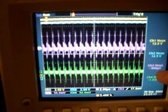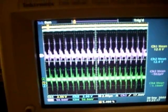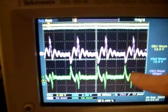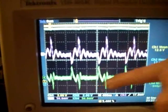Right here they both show negative DC values, and I just have these down to 50 millivolts. I'm not really doing power measurements here — I'm just showing you basically what the waveforms look like. You can see the ringing on the load; this is the timer down here, and they're basically kind of inversed from each other. You can see that this is the load because you do see the ringing. Here's the timer where you don't.